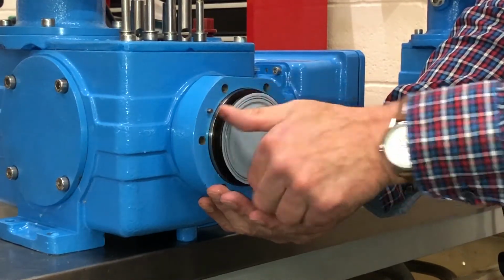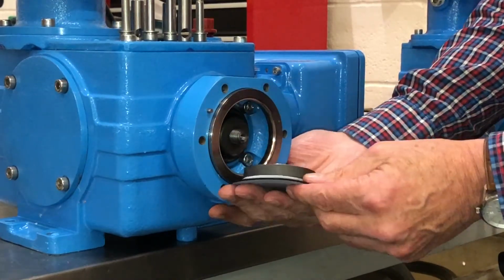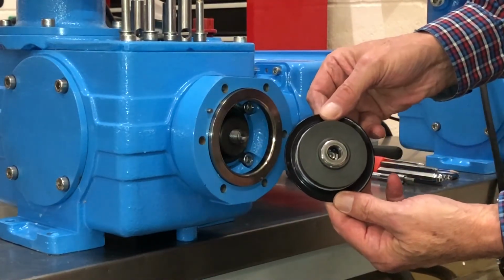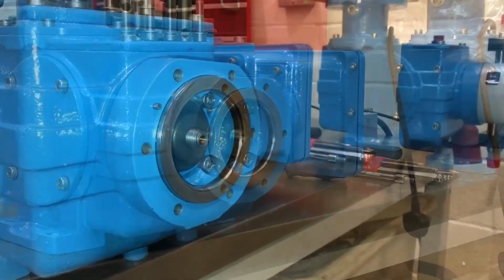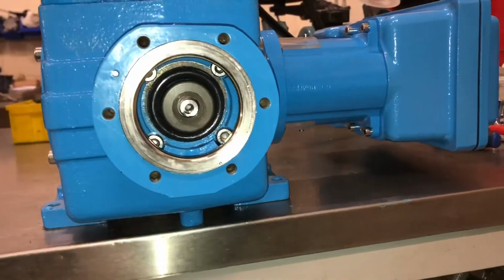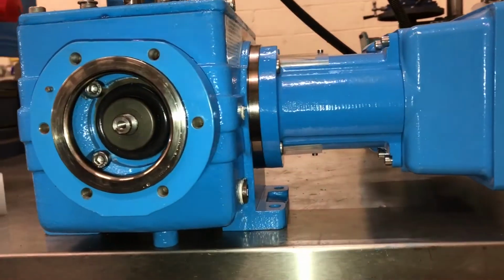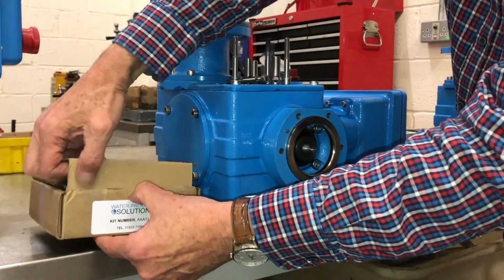When it comes to the end of the thread, it simply lifts clear, and you can see on the back of the diaphragm the threaded boss. And when you look inside the head itself, the gearbox behind the head, you can see the connecting rod poking out with the bellows seal on it.